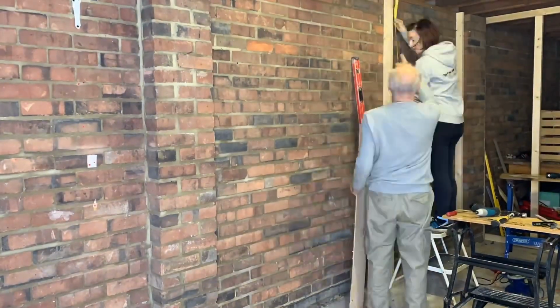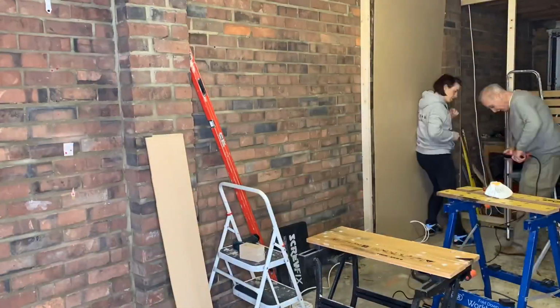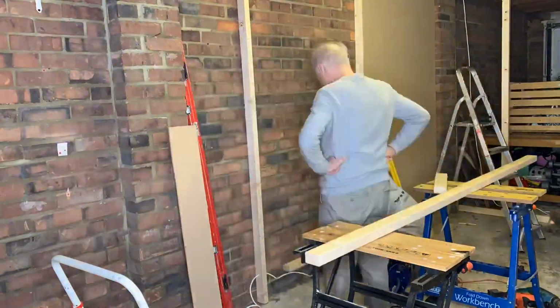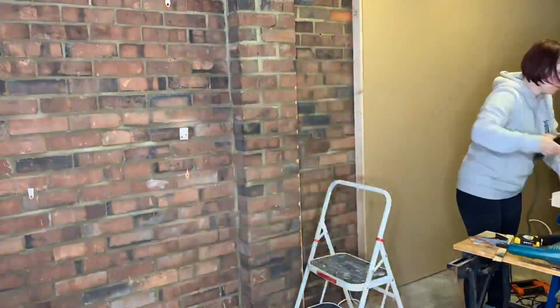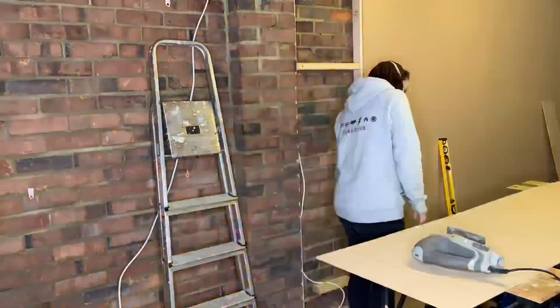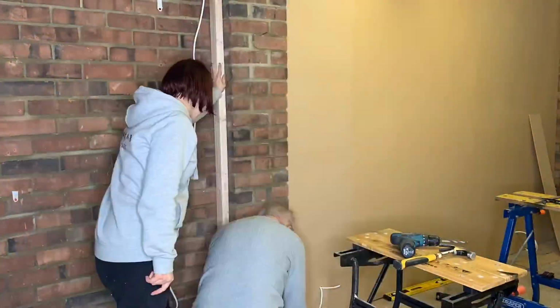It's worth noting that for the walls, we put the battens up as we went, rather than all together at the beginning. This allowed for any discrepancies in our measuring. We also fitted the wiring and wall sockets as we went too. I'm not going to go into the wiring in detail as we are not qualified electricians and your system is probably different to mine. And so we continued in this manner of battens, insulation, MDF board all around the walls.